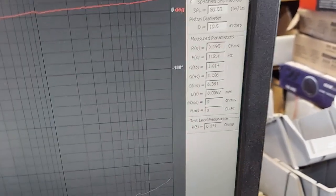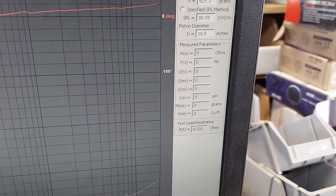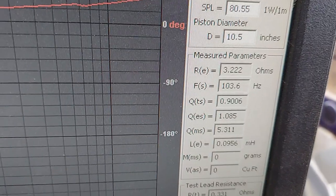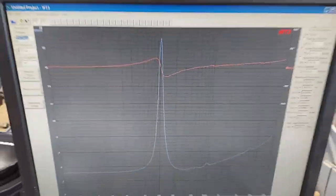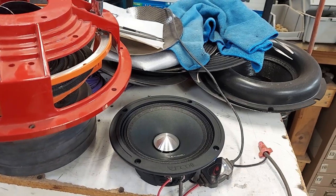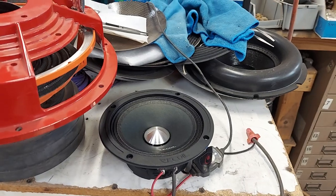We're at the FS — 112.4 hertz. Let's do it again. A slight change — still right around 100 hertz. The peak got way peakier, but that's well within the parameters and it's not going to change any crossover frequency. You still want to cross up at 400 hertz.